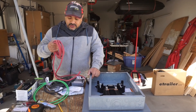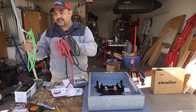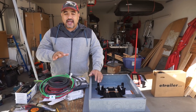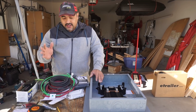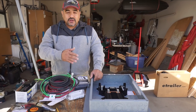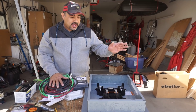So we didn't feel safe using the 50 amp cord. We're going to use 2-gauge wire for our mains - two colors of 2-gauge and a number 6 for the grounding cable. This is a 125-amp box with only three legs. The 50 amp shore power comes in with four legs but we don't use the last leg. We just wanted to be doubly safe that everything was within spec and we weren't going to worry about burning up any wires, just in case we boost the inverter through the 50 amps.